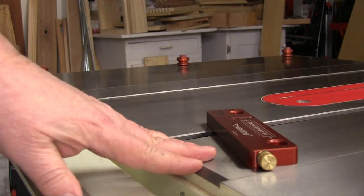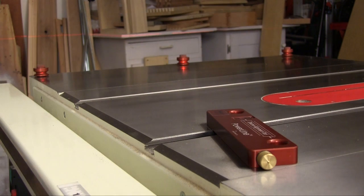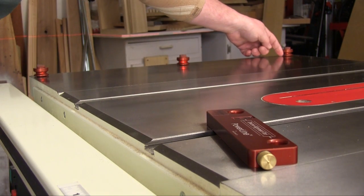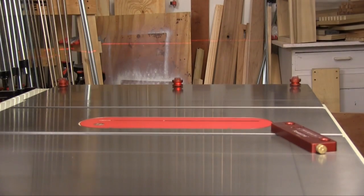You can also check bigger surfaces like on a table saw. I put the bar at the edge of the table saw surface, not the wing. Then I can shoot it across and check the other wing to make sure that it's flush and parallel with the table surface. To check the other wing you can just turn everything around, or slide the bar to the other side of the table saw to double check your readings. While doing this test I found out that one corner of my wing was about 1/128th of an inch low, and we fixed it.